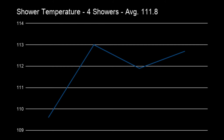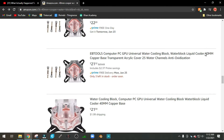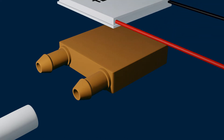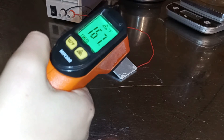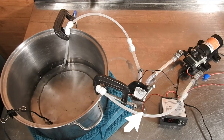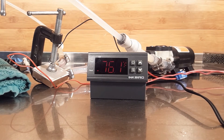For the build, I started out by figuring out how I could transfer heat from the module to the water in the most effective way possible. After looking at a few different options, I found a 40mm by 40mm water block that fits perfectly on the hot side of the Peltier module. Unfortunately, the Peltier module cannot provide enough heat to the water block, meaning we cannot use this as a tankless water heater setup. As a tank, I will be using a pot and a pump to circulate water from the water block to the pot. Finally, as a controller, I will be using a temperature controller to help maintain and display the temperature.